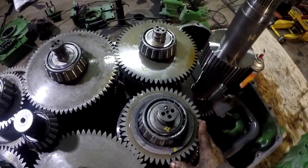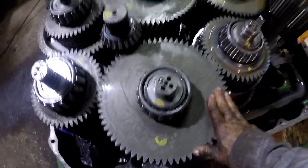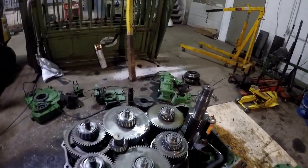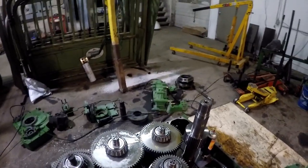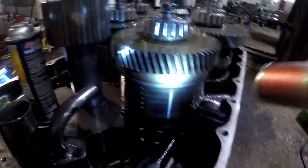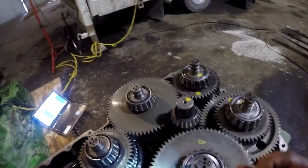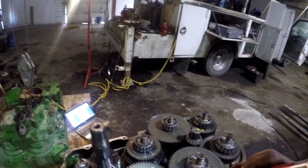Here's clutch F, which will be our sixth stage. Clutch G is our seventh stage. H is our output. You'll have a speed clutch and a range shaft on both shafts. I think I can actually get clutch E - our problem child - out of there pretty simply. That's actually the one that's not too bad to get to. But we're going to do them all - there's no sense in going through all this and not doing every one of them. Let's get this one out of here and see where our problem is on fifth stage.